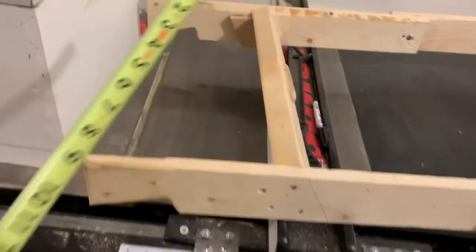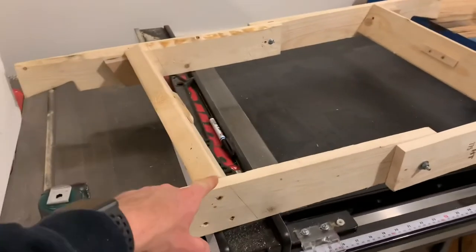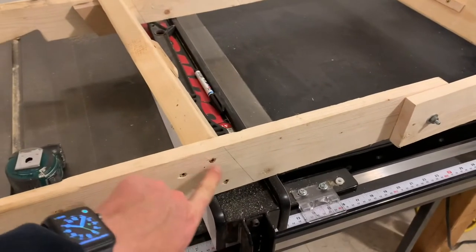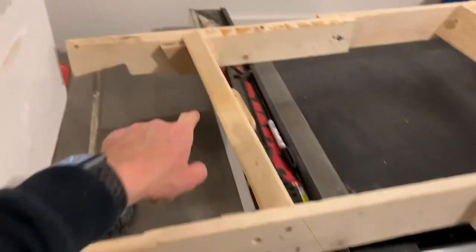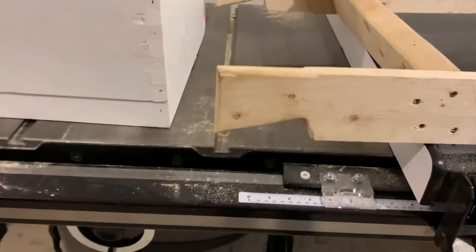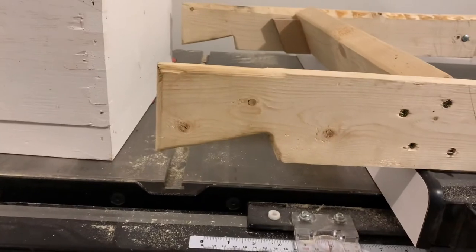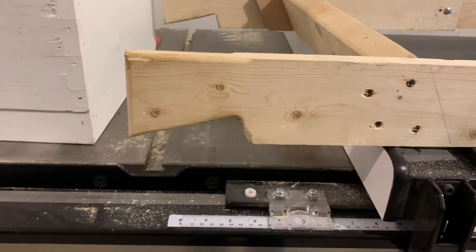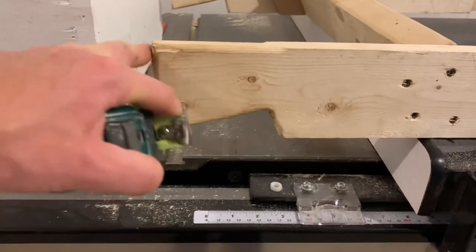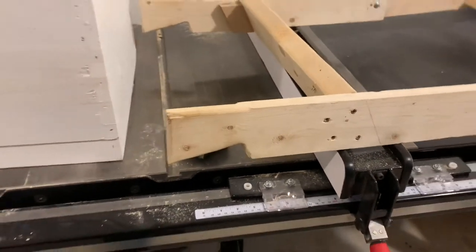Because of the pressure — these hives are really heavy — I was concerned about the weight pushing down and pushing against this with just some screws, so I added a block of maple to tie it all together. I added some handles just for comfort. I just put a square up there, set it to whatever angle looks right, ran around that, and it gives a pretty nice handle.